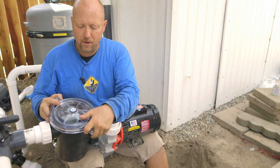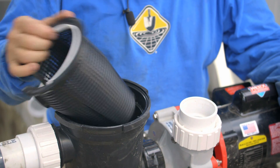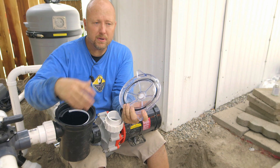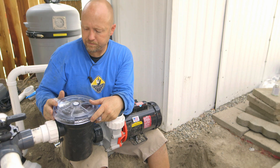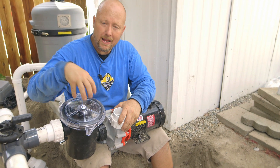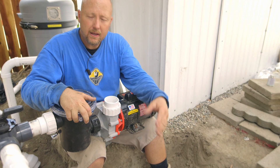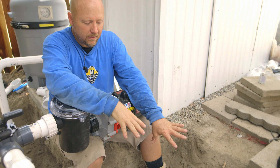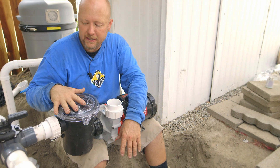What you're going to have to do to prime it is have this priming pot. It's also a spot for us to capture any leaf debris that might get by our pre-filters. Since I'm going to want to add water to this, we're going to put some check valves below grade. I'll show you where we're going to do that so we can add water to this and purge the line of all the air that might get trapped in here.